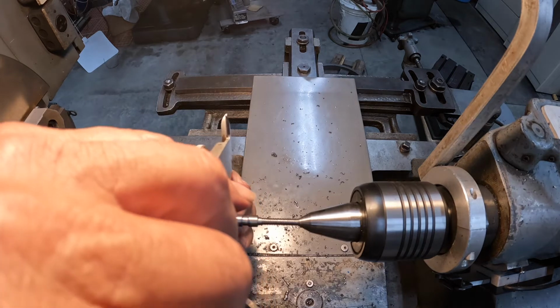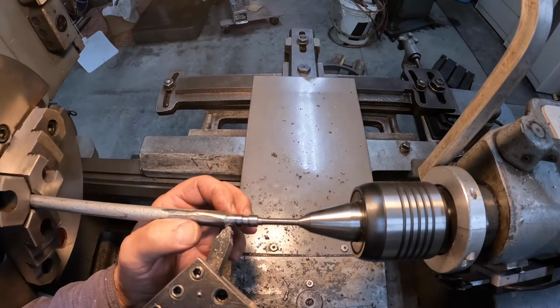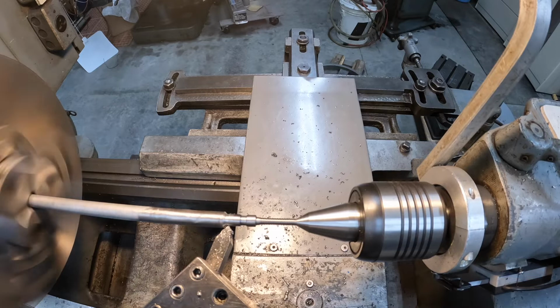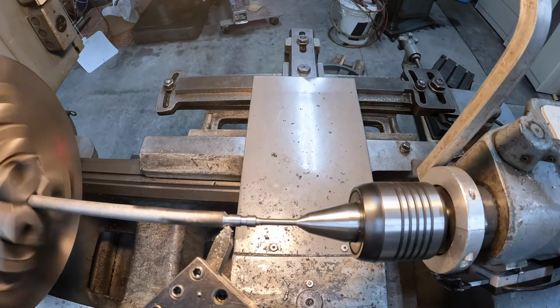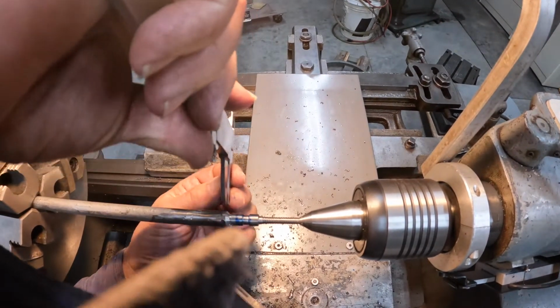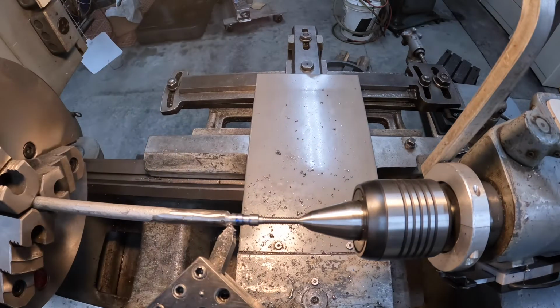Be at 300, and then 45 thousandths more to go here. So been a 25 thousandths cut. Check. 20 to go. So I'd be dead on them. 20 thousandths more would be right on the money.